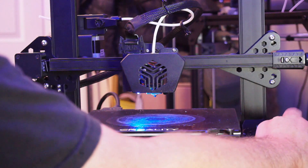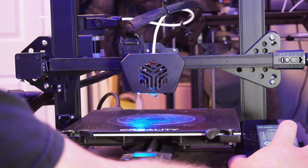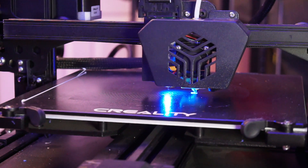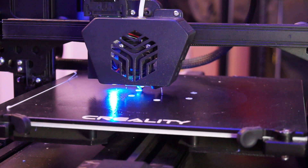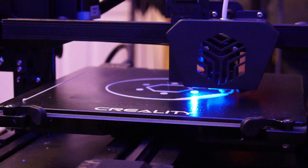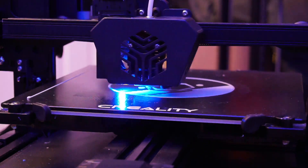That's now finished. The really good news about this community firmware is that I can now do a PID tune directly from the UI — I'll put that at 230 degrees, hit the button and start tuning. Now we start printing. This is the Polymax PC polycarbonate filament, 1.75mm and 750 grams. Printing temperature is 250 to 270 degrees. The CR6 SE tops out at 260, with printing speed between 30 and 50 millimeters per second — most of my prints are actually done a little slower, around 20 millimeters per second for this type of filament.